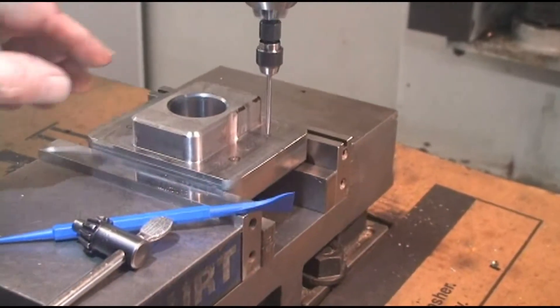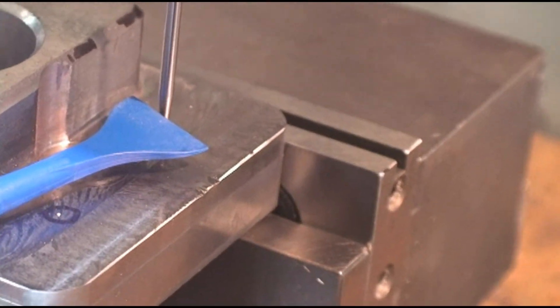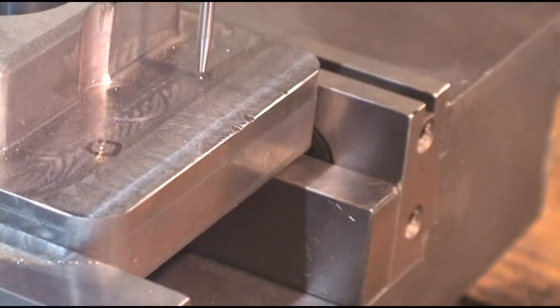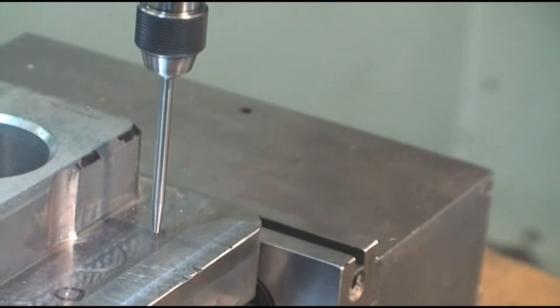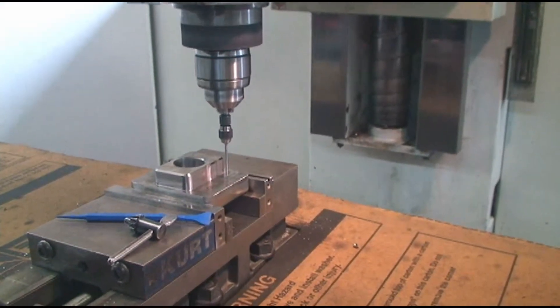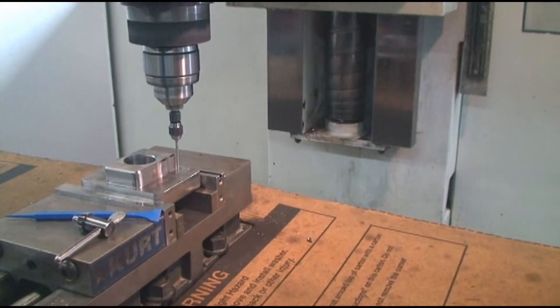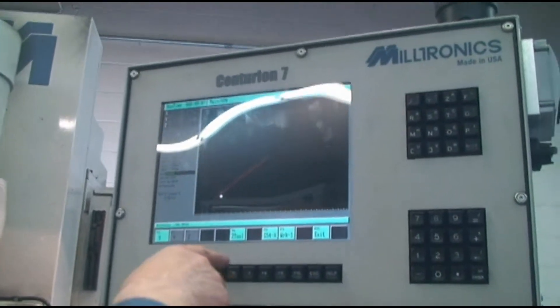The way I'm doing these transfers is by picking up the prick punch marks with a wiggler, which is wiggling right at the moment. Stop it using anything but your finger. Now when you've found your location, you have multiple ways to do this. You can do them one hole at a time, or punch the holes out and do it in the drill press, or you can do it like this. Obviously I don't have a drill press, so this is the way I am doing it.